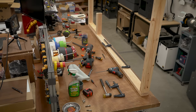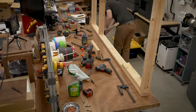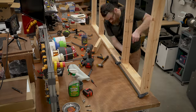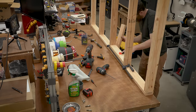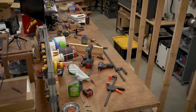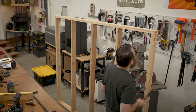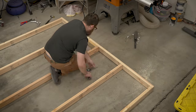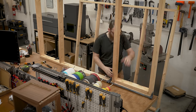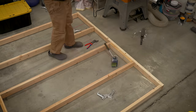I got my time-lapse settings really wrong for this clip, but I put the long horizontal piece on the workbench and then added the vertical pieces. I used a scrap piece to make a spacer block so I could easily space all of the uprights — started from the outside, went to the inside, and that was all pretty simple. For adding the top horizontal piece, I tried doing this vertically but it was a pain, so I laid it down on the ground which made it a lot easier. I then repeated this whole process with the second frame, which took about half the time.